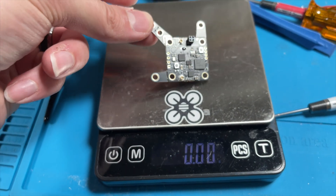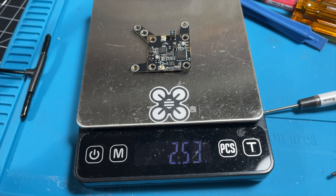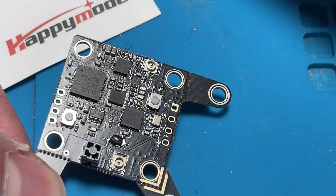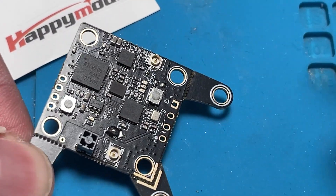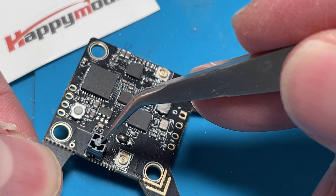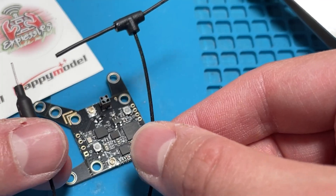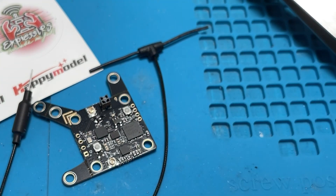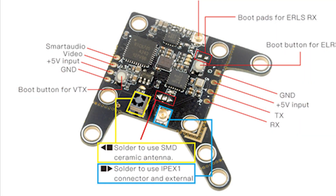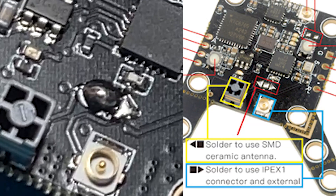The combined video transmitter and receiver weighs just 2.53 grams and you can drop that weight further by removing the perforated edges that you don't need. The Fusion board comes with a full range ExpressLRS receiver. It's got the ceramic antenna but it's also got a UFL connector to put your own antenna. A T antenna for external use is included in the box, but if you want to use it with the Fusion 2.0 you've got to desolder this blob here because by default it is configured to use the ceramic antenna.